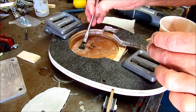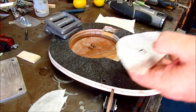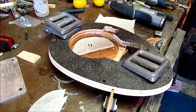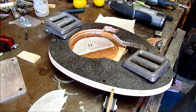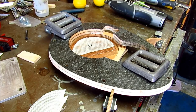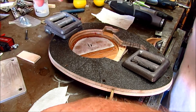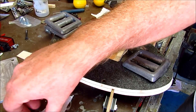Here we go. I feel sorry for him, whoever he is. Here goes layer four. The reason I'm putting — you could just pour resin in here and let it set up, but guys who've done enough layups and played with fiberglass enough know that resin is actually not particularly strong all by itself. You actually need the fibers, you need the weave, to provide the strength to the resin. So that's why I'm putting in the fiberglass cloth.